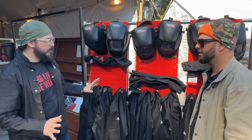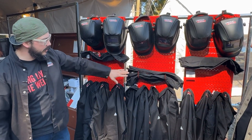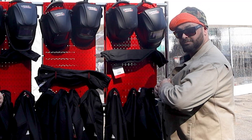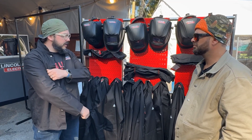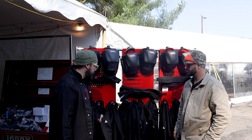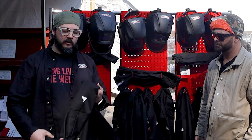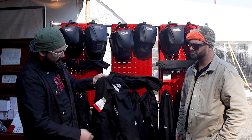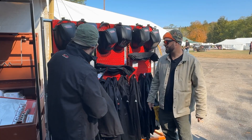What about our arms? We've got a couple of options here. We've got some traditional sleeves and some leather sleeves. If you're already wearing an FR shirt or a cotton or wool shirt and it's 110 degrees inside the shop, you can just slide those sleeves on — they keep you protected from the sparks, spatter, and UV radiation. The more traditional option is the welding jacket, which is FR — flame resistant or flame retardant — made with natural materials, usually a treated cotton. That's the minimum you need.